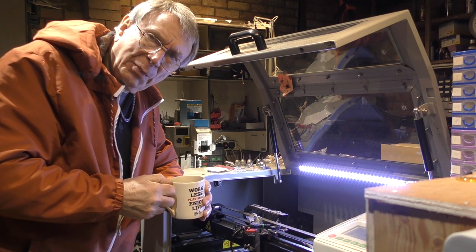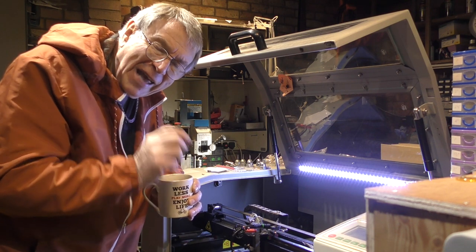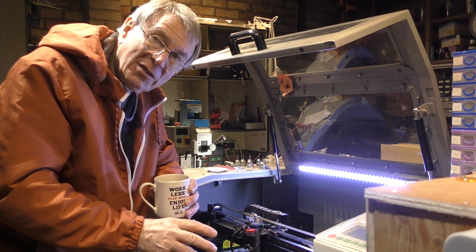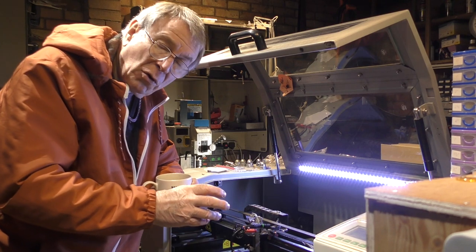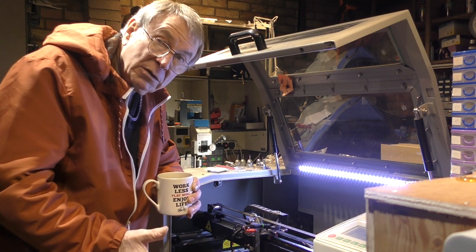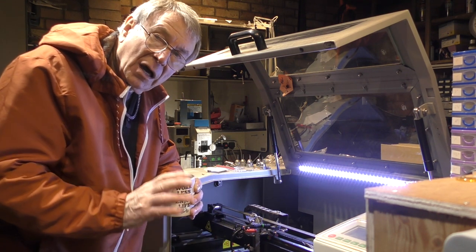I think that's enough to give you a pretty good idea of what cutting is all about. I've covered all the basic points, and then the last final conceptual point about this very high intensity spot of light right at the centre of the focal point, which has the ability to do damage a long way below the focal point. But it all depends on this thing called exposure time. The lens has given you the intensity. The shape of your beam has given you the intensity right at the centre of the spot or the focus point. But then its ability to do damage way below the focus point, well, I've proven that beyond any doubt, I think. But that's the conceptual difficulty that people have. They know that it cuts, but they don't understand why it cuts. I hope I've now made that clear to you.